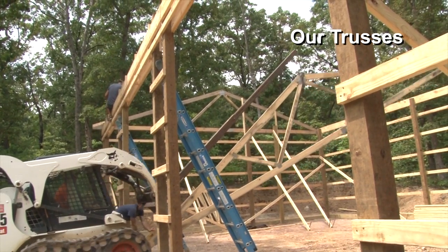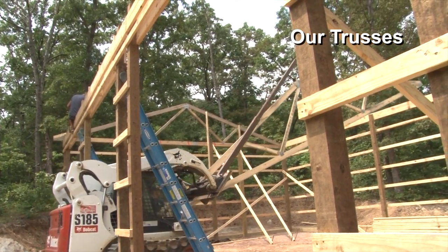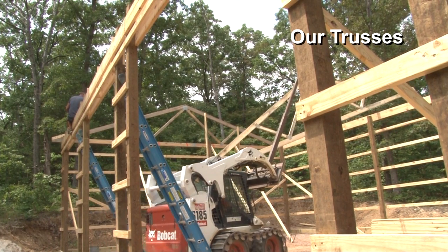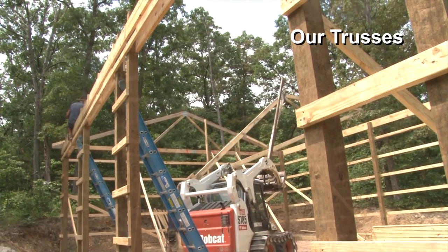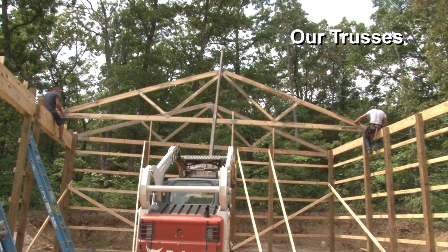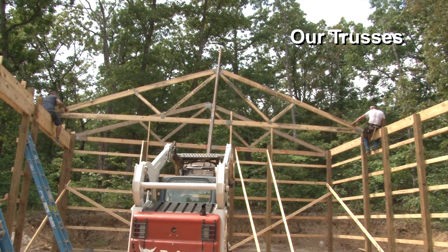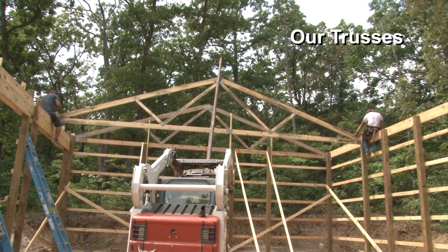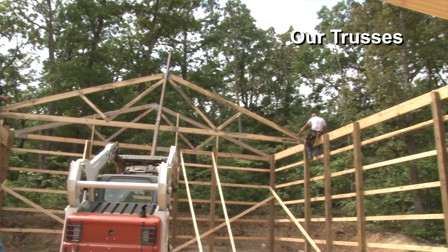So you're in the 30-cent-per-square-foot range, and you can multiply that by the size of the building versus going four-foot center with a 29-gauge, a lighter gauge metal. Ultimately, you're going to achieve the same goals. A four-foot center truss is exactly half as strong as an eight-foot center truss — you're not necessarily making the building stronger. We can engineer for nearly anything. There are other reasons to go with two-foot center as well.